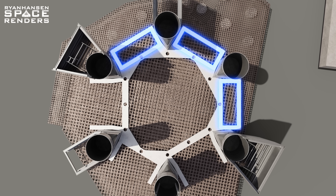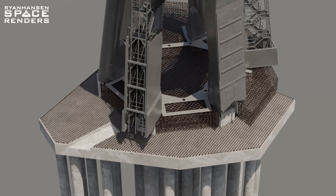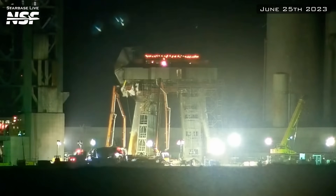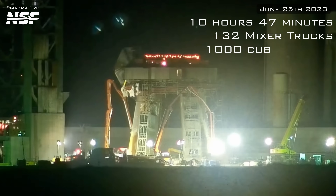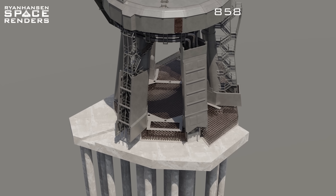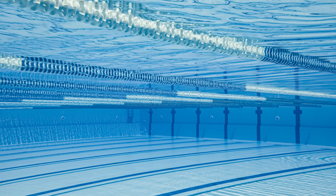With the remaining formwork installed around the perimeter of the lower level, they were able to begin the first half of this massive concrete job. The bottom layer of this foundation is about 1.8 meters thick and the top layer is 2.2 meters, so this job had to be divided into two sections. Starting at 10 p.m. on June 25th and continuing over a period of 10 hours and 47 minutes, 132 mixer trucks were used to deliver just over 1,000 cubic meters of high-strength concrete. This number assumes each mixer truck has a capacity of 7.6 cubic meters. We expect the second layer will require about 858 cubic meters, so that will be an additional 113 loads. This is roughly 4,600 tons of concrete and enough to fill three-quarters of an Olympic-sized swimming pool.